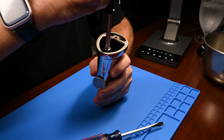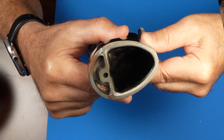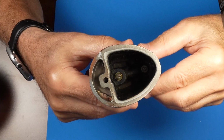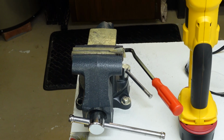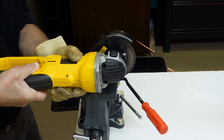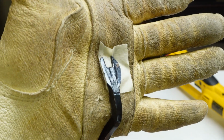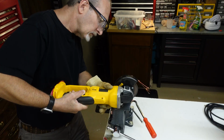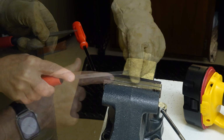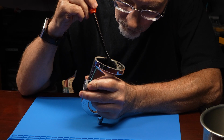One of the 2 lock nuts under the staking press could be loosened with a regular socket, but the larger nut requires a specialized spanner wrench, which I don't own. Here I'm trying to modify an automotive clip pry tool by grinding down the edge to fit between the lock nut and the side of the press. I had to adjust a few times, but I finally got it to fit. I'm sure it's not the best solution, but it was a solution nonetheless.